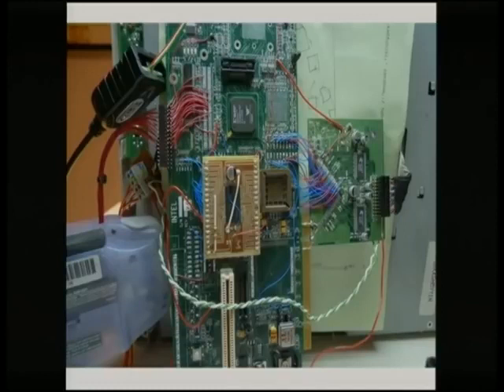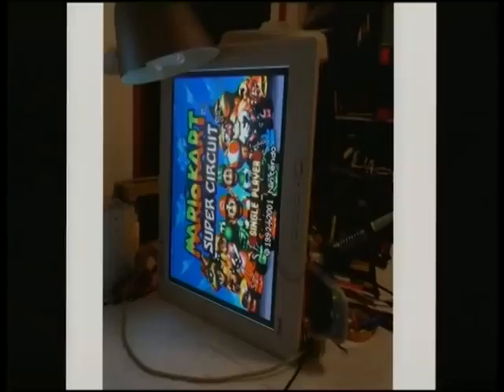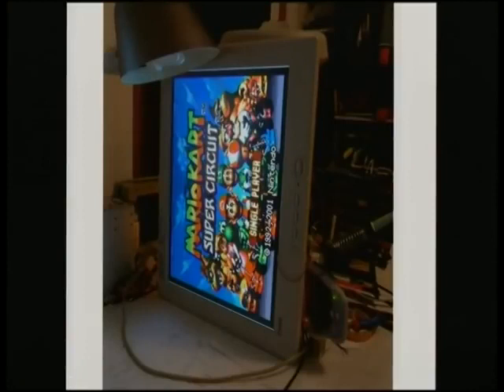I added a small RAM chip for a frame buffer and connected a trusty Game Boy Advance - which I hadn't played in about 10 years - as a reused video source. It scales up the GBA video and displays it on a nice backlit 1280x1024 screen. The board is rested sideways because of how the wires are, which is actually how it's meant to be. Rotating the image makes the lighting go funny and your brain hurts - but that's the nature of a GBA display scaled up. My plan is to make it run a BBC Micro emulator - a little English computer from the 80s - though that's partly done and not ready to demo yet.